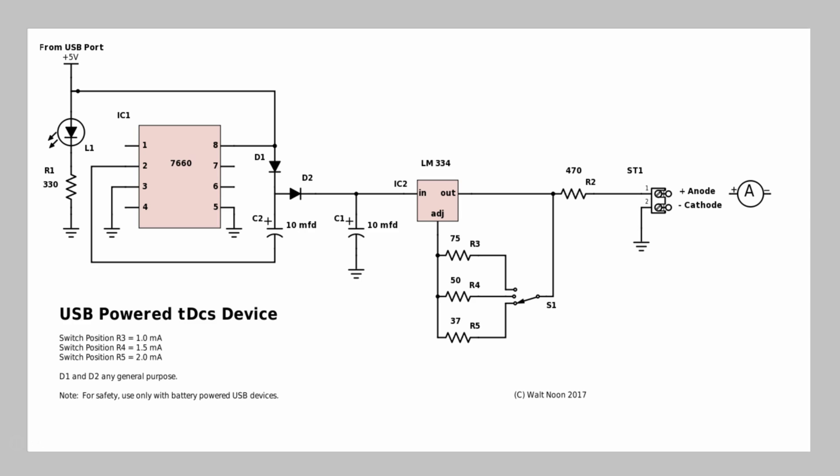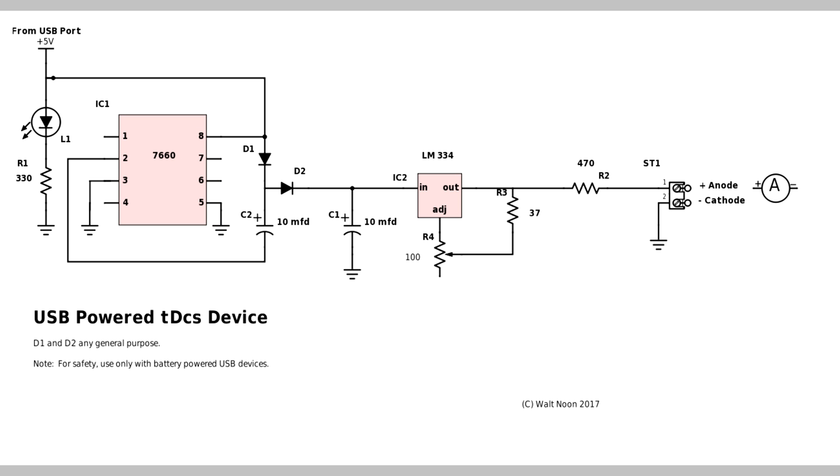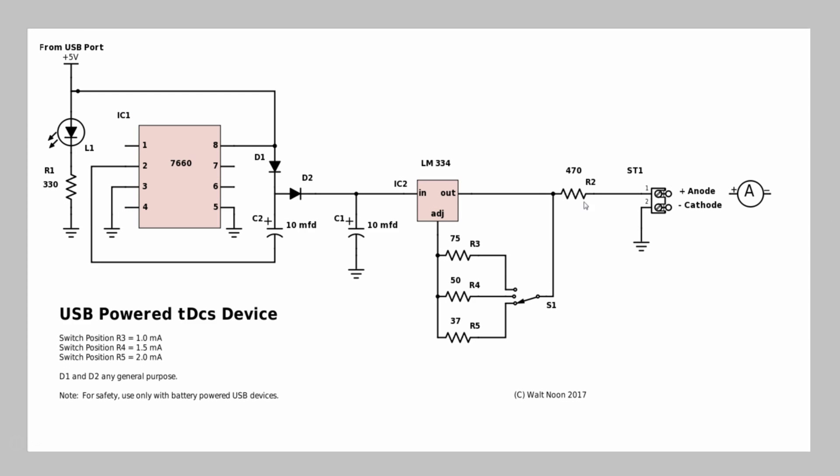With these two devices wired up, a resistor feedback network allows you to select between 2 milliamps, 1.5 milliamps, or 1 milliamp output. On my own unit I just wire it for 2 milliamps — it's such a small current I don't really feel it. You can also swap those resistors for a 100 ohm potentiometer to dial in any current within that range. Just make sure to keep the 470 ohm resistor in place so you don't exceed the safe range. The kits I'll make available will just require you to connect two wires to the anode and cathode output.